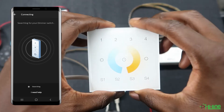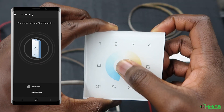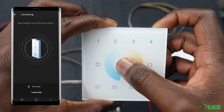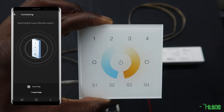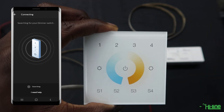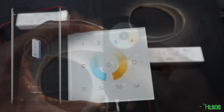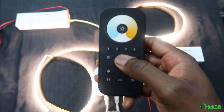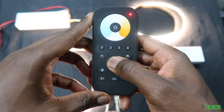You can add as many remote controls as you want while still in the search screen. Go ahead and add the wall mount the same way: press and hold the power button, wait for the LED indicator to come up, then press S1. It will start blinking slowly and then blink five times quickly to show that it's been paired to the Zigbee smart hub device. After that, pair the remote control to the LED controllers via touch link commissioning as shown earlier.